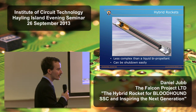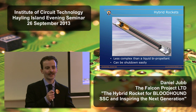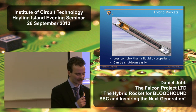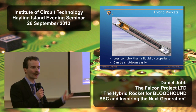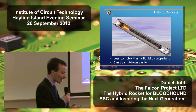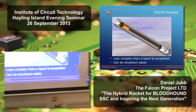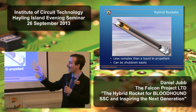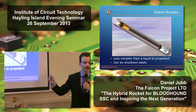So we then come to the third kind, hybrid rockets. Now, depending on your viewpoint, these combine the advantages or the disadvantages of solid and liquid propellant technology. I'm not necessarily an advocate of hybrid rockets, but they are a really good fit for Bloodhound. Essentially, the term hybrid comes from the fact that you have elements of solid propellant technology. Your fuel is in solid form contained within the chamber, and it will not burn on its own, unlike a solid propellant.